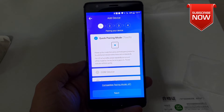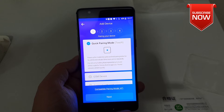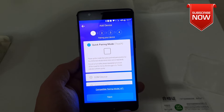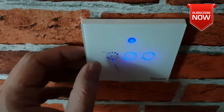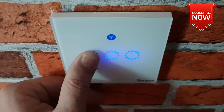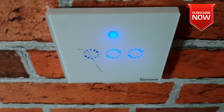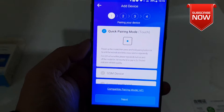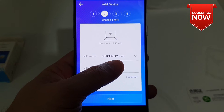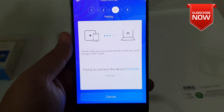To add the device, click the plus button and make sure the Wi-Fi LED light on your T1 switch is flashing every three seconds. If it's not, I'll show you how to put it into pairing mode. On your wall touch switch, hold down button number one for a couple of seconds — you'll hear a beep and see the flashing light. Then go to your application and click next. Type in your Wi-Fi credentials; it only supports 2.4 GHz Wi-Fi. Press next and wait.